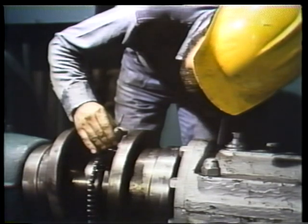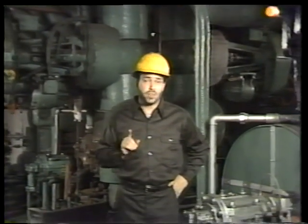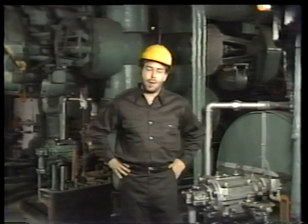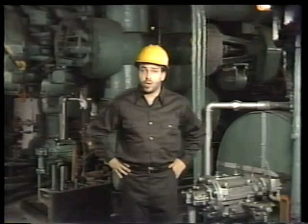After a few hours, have the pump turned off again and repeat the thrust reading one more time. If everything reads okay, the job is done. While testing bearings you've just worked on, look for three things: abnormally high temperatures, excessive vibration, or unusual noises — any of these symptoms indicate trouble. If you notice anything that doesn't seem right, stop the machine immediately and find out what's causing the problem. Temperatures will go up as soon as the shaft starts rotating, but they should level out pretty quickly. Find the bearing's normal operating temperature by looking at your plant's maintenance records or the machine's operating records.